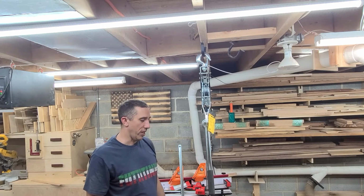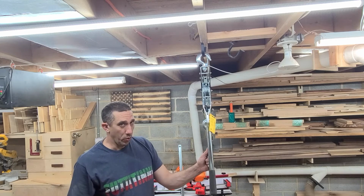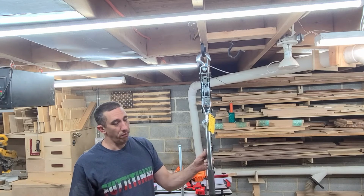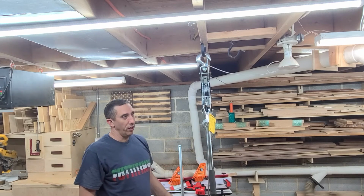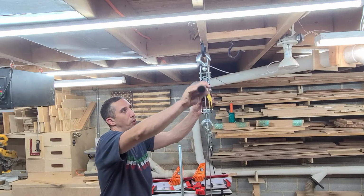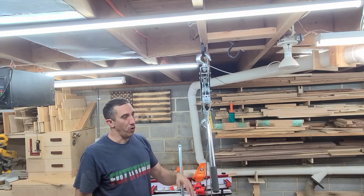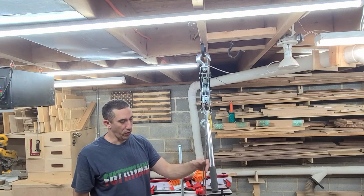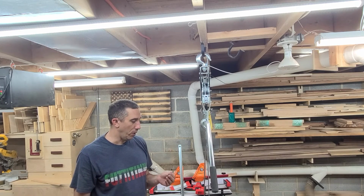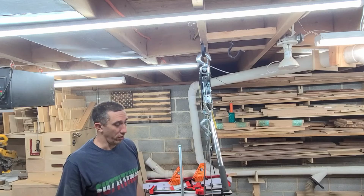Same thing if you're going horizontal. And remember, I think I said it before, if you're going to do double, when you double up the wire with the movable pulley, you double your load, but you're going to use twice as much cable to go half as far. If you were single and weight wasn't an issue, without the pulley, you would be able to go faster because you're using, you know, whatever this one full throw is, say it's 6 inches, you're going to get 6 inches of throw. In this position, you're going to get 3 inches of throw, but use 6 inches of line. So you're obviously not going to be able to pull as far when you're doing your double, when you're doing your mechanical advantage 2 to 1. Anyway, I don't want to go too crazy. This is pretty simple. I like the setup, and I'm sure I'll use it in the shop a lot.